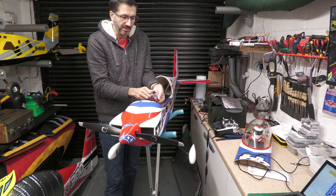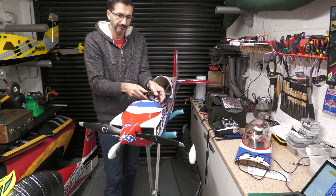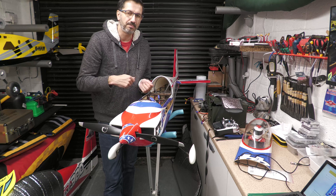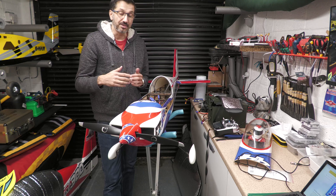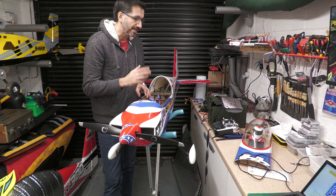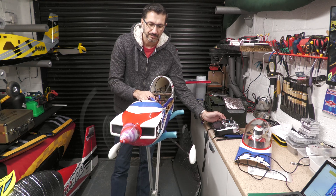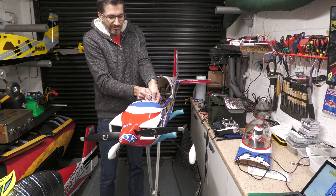Re-plugging the batteries with the model on - that's better! Two sets of beep sequences: that's my normal startup procedure - turn the model on, plug the batteries in, get the initial startup, the pause, then the second tone, and then the constant beep every ten seconds warning you the model is powered up. Everything should work now, so let's just try the throttle with a couple of clicks. Perfect! Let's pull the prop for safety.